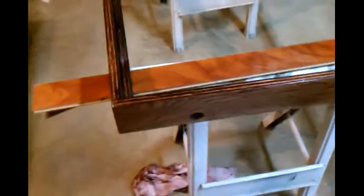Here's my main board for the train table and I think it looks pretty good — it's almost done. I applied 4 coats of polyurethane. This is what I did with the boards: I cut a 4-inch strip and took those strips to make a big frame. Then I took the 2 and a quarter strips and made a little frame.